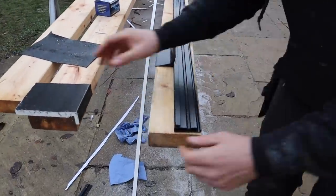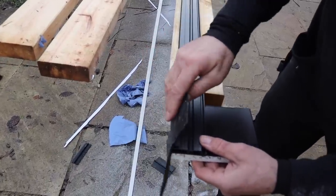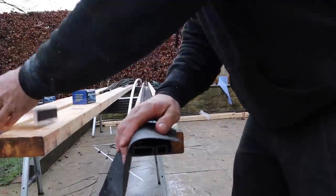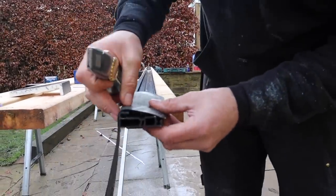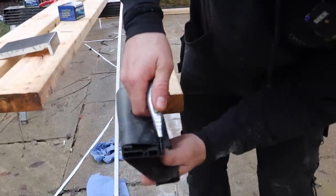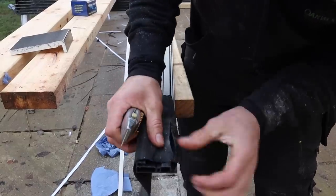That's the first part that fixes to your fascia. Then your rubber trim goes over the top. Imagine that's your deck — you've bonded your rubber on, you've got your overhang there. What you want to do with the overhang is cut it: I locate my knife into that groove and just drag my blade down the groove like that.